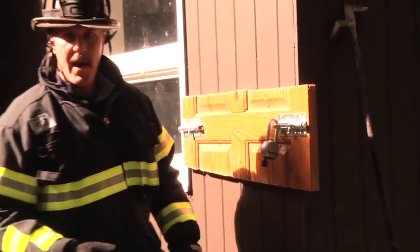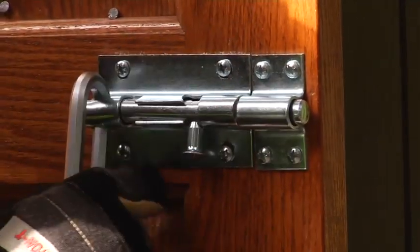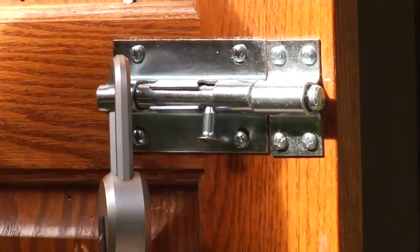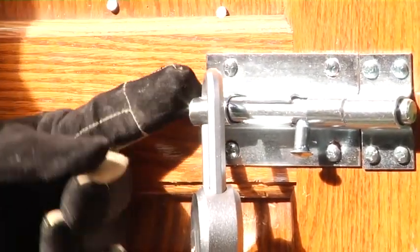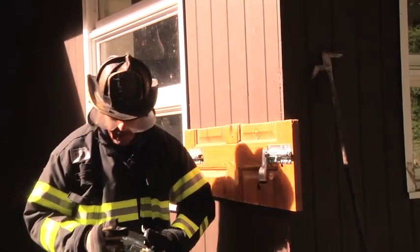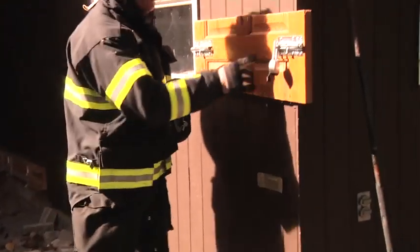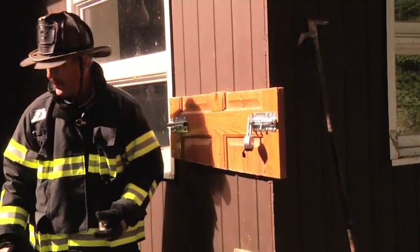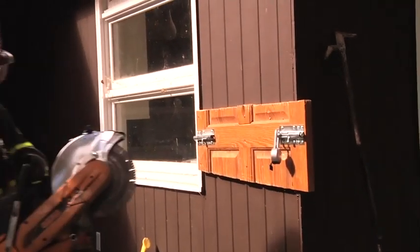We just witnessed one area. Remember, he spotted a seam. He's just going to cut the barrel. He stayed away from the lock. The other area he can come in now, leaving the lock alone, is to come in on a bevel to the back here and just cut this narrow spacing between the body and the lock, okay? Kevin, just come in on the diagonal right here. You don't have to cut it the whole way.